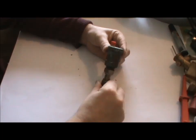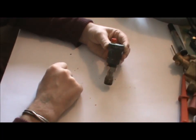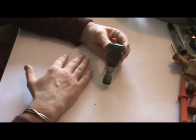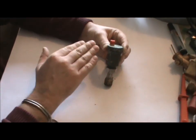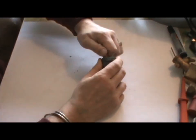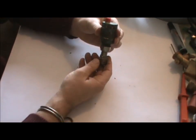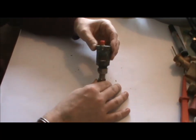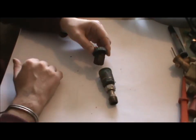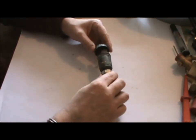This is an automatic air vent, fitted on most sealed systems and combination boilers at the top just above the heat exchanger — and these usually leak. They're under quite a lot of pressure and they do function quite regularly. They usually leak when first operated and should then seal. You can leave them open to work automatically or shut them completely. Always check that these aren't dripping. If you don't have a replacement at hand, just unscrew it and lubricate it — all it is inside is a little float. Give it a wash, put some Vaseline or lubrication around the side, and insert it back in.